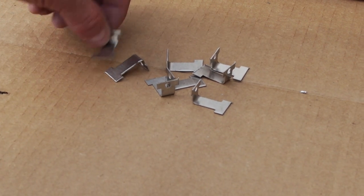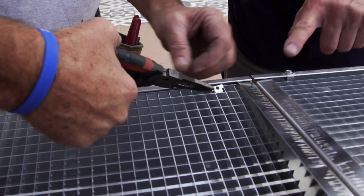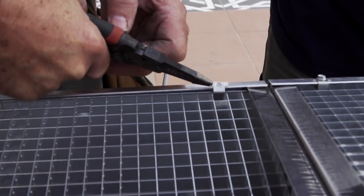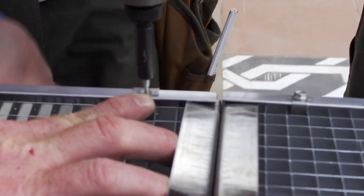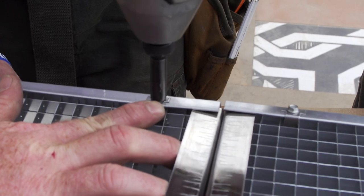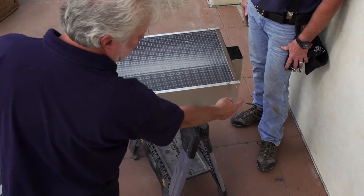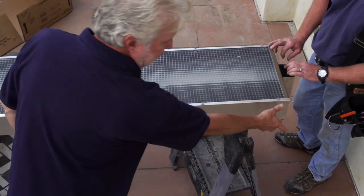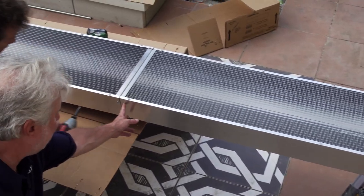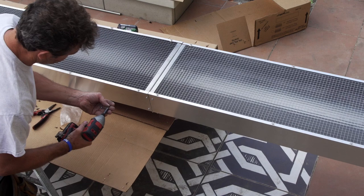Included in the bag of screws are what we call grill clips. We put it in at a diagonal, the T-portion going down in one of the squares. We want to space them similarly to how we do on the main unit. Once it's placed down in there, we rotate it — a pair of pliers is the best thing to use. We rotate it and let the other end of the clip rest on the lip of the reflector, then take one of the same screws out of our screw bag and simply screw it down. The last step is to place our screws on the side of the reflector — we left those out to make it easy to separate the reflector to insert our grill. So those screws need to be added on the end of the unit and at the very beginning of the extra piece of reflector.